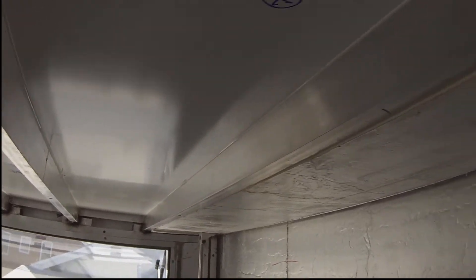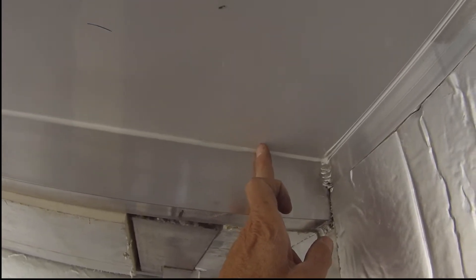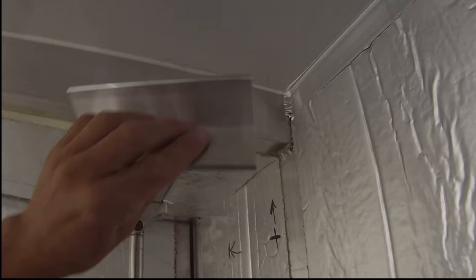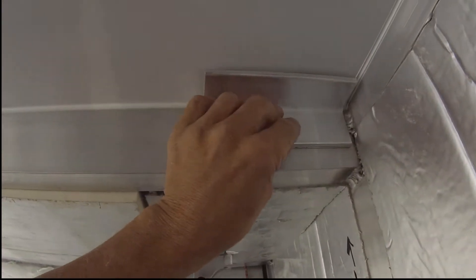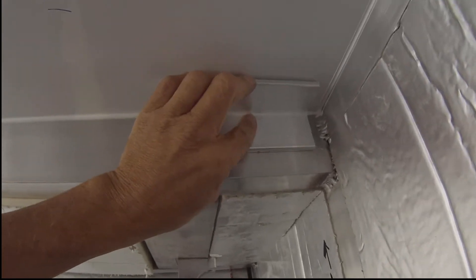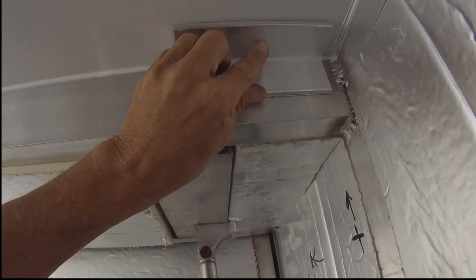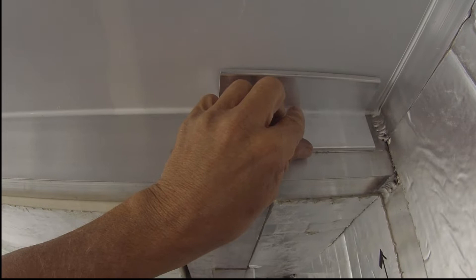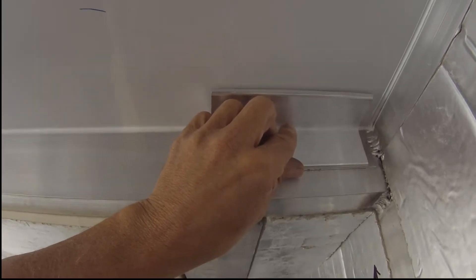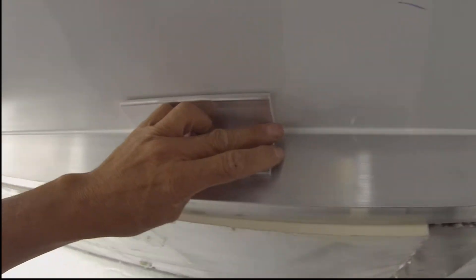The way it's gonna work is the mounting holes in the solar panel - I'll be able to mount the u-channel with a bolt to some stout 316 angle and that's gonna go up against the ceiling. There'll be one here, I'll drill up with a bolt, I'm gonna epoxy the bolt and washer to this so I'll have a stud sticking through the roof, and that is what I'll bolt the u-channel to.